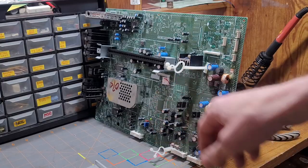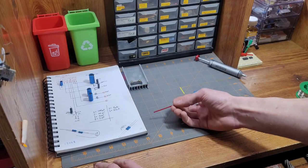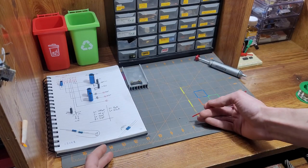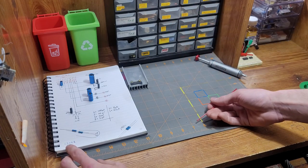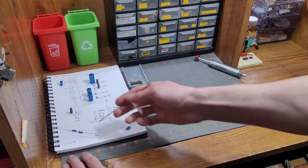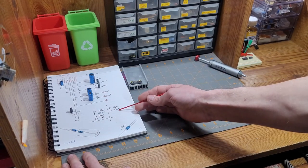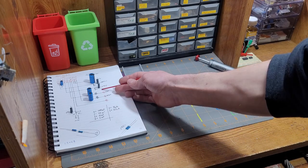So we're going to go to the board for that. Well, after searching all 3 of those boards, I couldn't find any of the resistor values that I needed. I couldn't even find anything that would have added up to the resistor values I needed. So I ended up having to break into my own personal stash. I took a 1.5K and a 6.8K, so when I put them in series, they'll add up to 8.3K, which is only 100 ohms off, so that's fine for me. Then I took a couple 10Ks, which is exactly what we need to pull down the inputs.